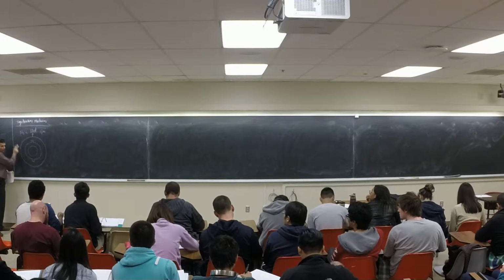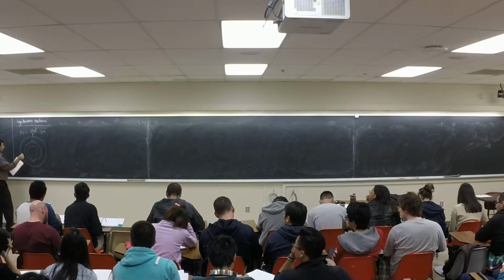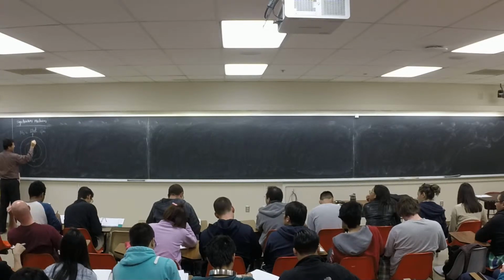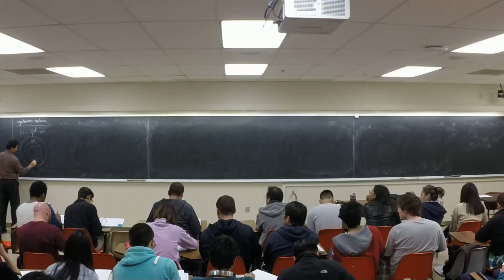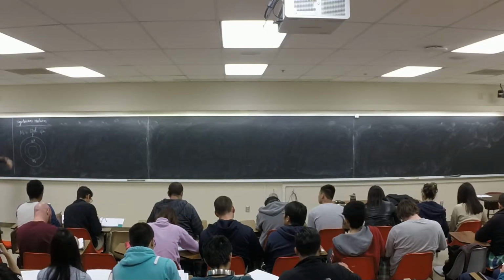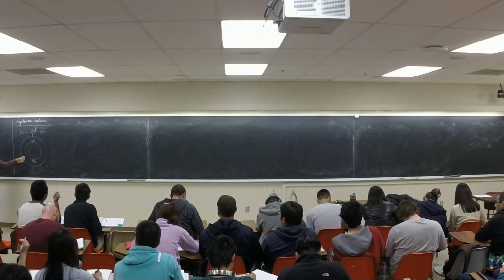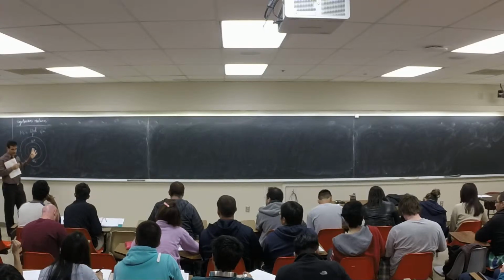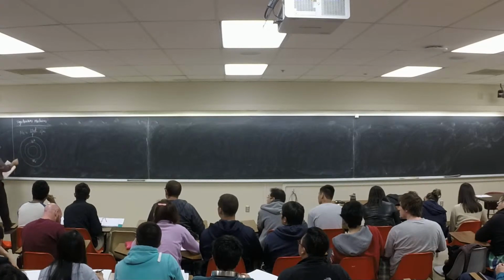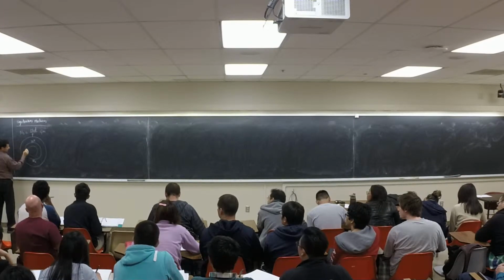Basically, I have one coil going like this, right? This is the phase A. Let's call this one, for example, the current going inside. Let's call this one A, and this one is going to come out. Let's call the other side A prime, right? B is going to be 120 degrees far from this one, and C is going to be another 120 degrees far from this one. So if you draw those, B is going to come here. Look at here. This is the direction here.